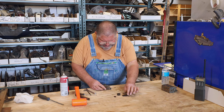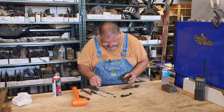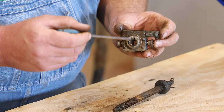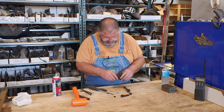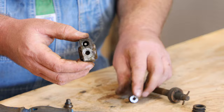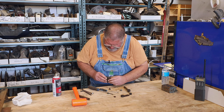What we have here is a set of screw threads on the inside being turned by this worm gear. There's a circular nut on the outside with threads — the cable comes through and turns this worm gear, which turns the nut on the inside to move the bolt in and out. With that plug out of there we can get in there and clean it out and lubricate it. These give us some access to the gear teeth on the outside wheel. This looks like it's in real nice condition — it wasn't binding up. I can look in there and see that the gears are not stripped. We're real lucky this is in good shape.